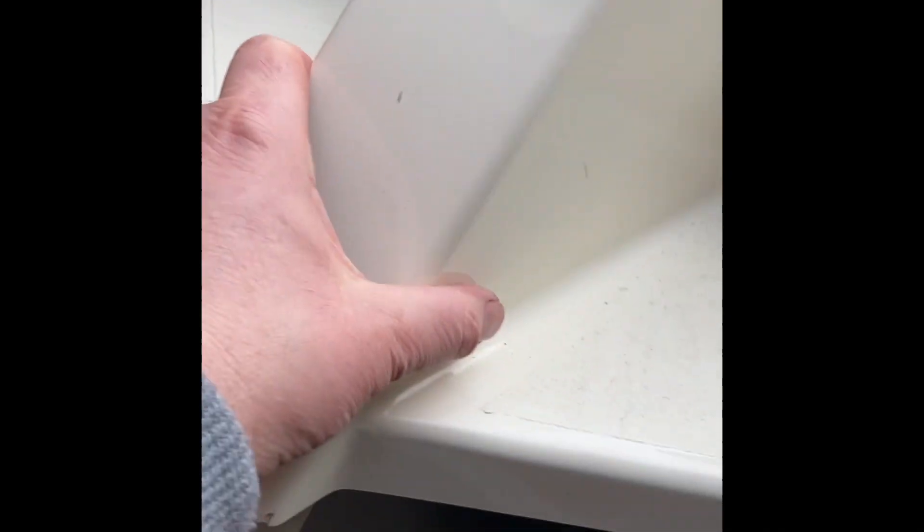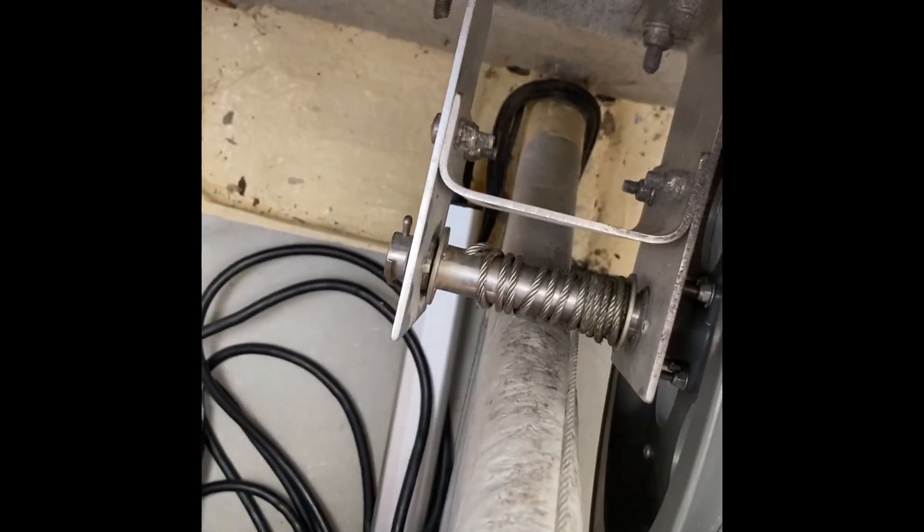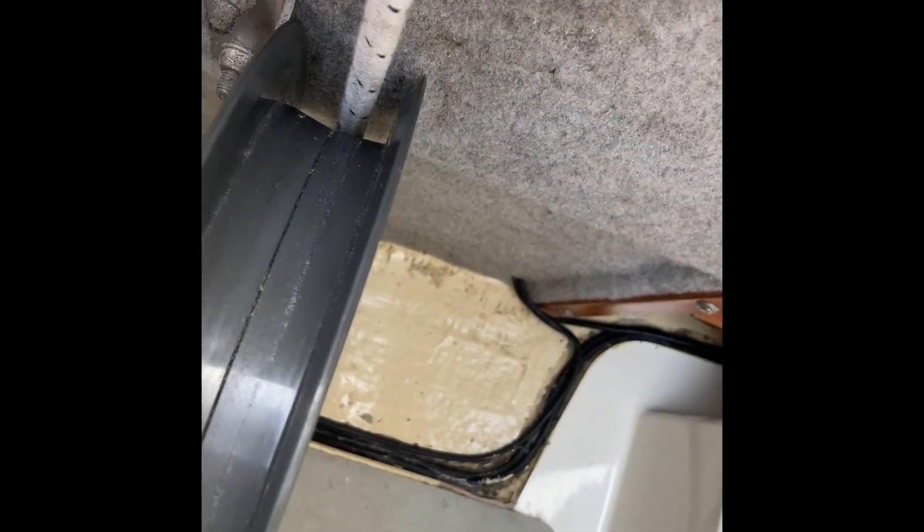I've propped the centreboard underneath, so now I'm just going to take the step off with these nuts and then I should be able to get to the winch and replace the winch wire. So the step's off, and now I can see the winch more clearly and the winch wire which is spindled around here. That looks like it needs to be replaced, and there's a hatch top here where I think you can get access to the top of the wire.